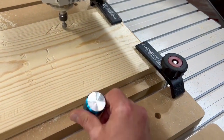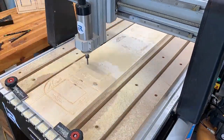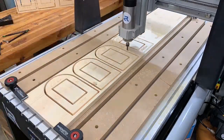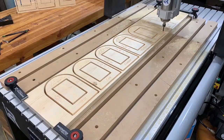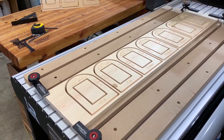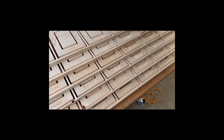Move the touch-off probe to where that piece is and it will just look a little bit better. Here on this particular frame, a cool idea with this frame project: you could use that interior cutout piece while it's already clamped down to do a bonus coaster or a bonus design, because it's all locked down as is. Just different batching ideas. With these frames I did not add a recess in the back — you could do two-sided carving mode, or use a router with a rabbeting bit to create that recess for the picture and a backer board.